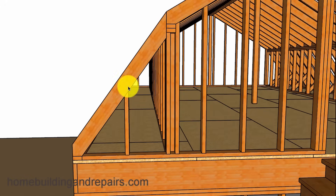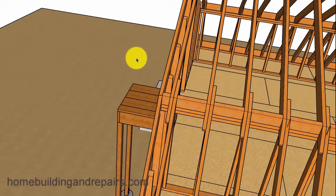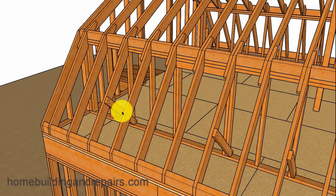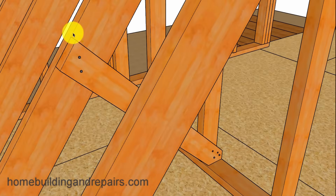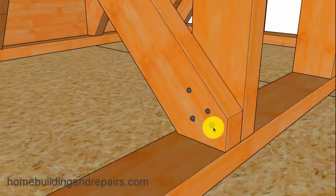The weight from the roof above might want to push this wall out, and the angle here might not be enough to prevent that from happening. However, a diagonal brace like this might help — I've seen this used before. You might need a brace like this on every rafter or at four feet on center. I can provide you with some information on how to attach the brace to the wall framing, which will probably include two 16D nails toenailed through the brace into the wall framing plate, and a couple of end nails going into the wall framing studs.